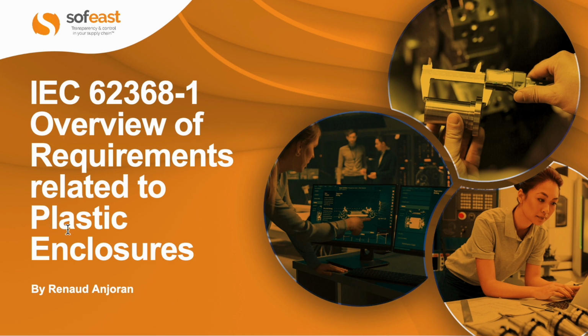Again, this was only about plastic enclosures. For example, when you look at metal enclosures for electrical shock, you look at whether it is connected to a protective earth. You don't have to worry so much about flammability because it is considered impossible to catch fire in many cases anyway, and so on and so forth.